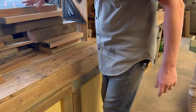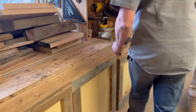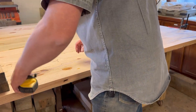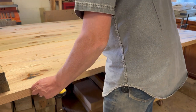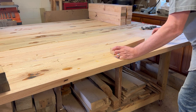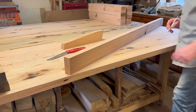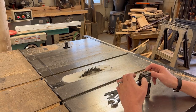Now I've moved on to the aprons. They're also getting a 15-degree cut. But on the legs those angles face the same direction, and on the aprons they face opposite directions. Now here I'm figuring the angle for my half lap that's going to cross underneath. I've drawn the size of my bench top and just pop a few chalk lines in that space from corner to corner.